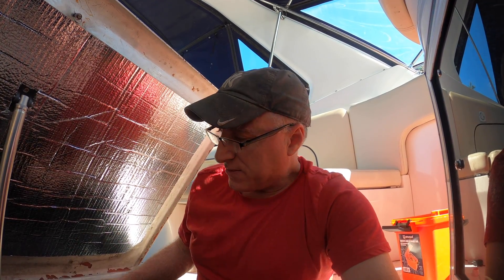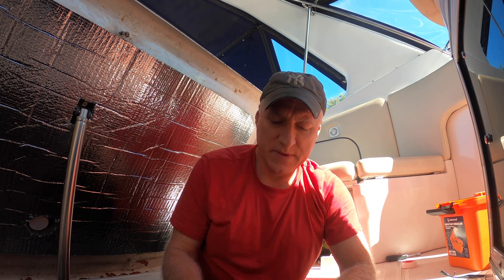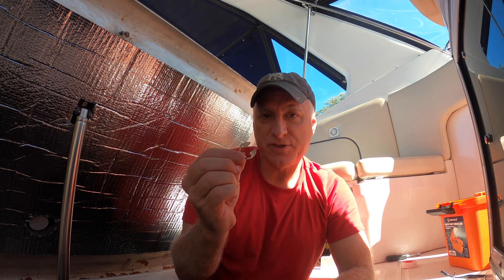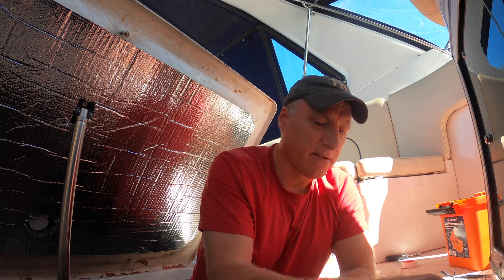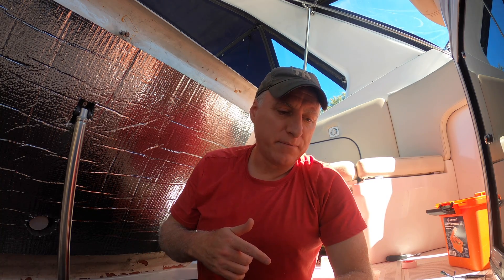So that's what I'm going to do right now — I'm going to show you that screen. Mary and I cleaned that screen out a number of times, but now what they want you to do is take it off and replace it with this e-clip. Looks like the bat signal a little bit. I want to be careful not to drop it in the bilge. I got two of these; each was about $15 on eBay. I'll leave a link in the description to the bulletin Brook sent me, so you'll have it if you have a Volvo Penta and problems with the electric fuel pump. Maybe this is one of the long-term solutions — replacing the screen that causes problems.